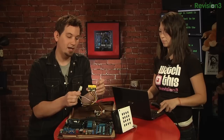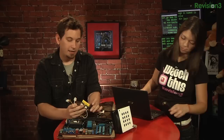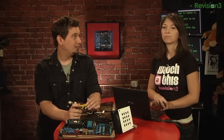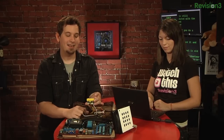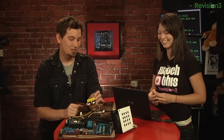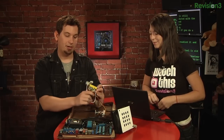The limitations that you're going to run into with these guys — and you can pretty much pick them up at whatever computer shop you fancy — is that I think this one was 160 watt. I haven't seen really big ones. If you're putting together this twice, one of the reasons is that this is not a gaming rig in any sense of the imagination. Pop a big honking video card in here and this thing's not going to boot. It's just not enough juice. So yeah, that's pretty much all you have to do is go and grab one of these guys and you're all set.